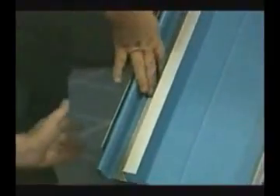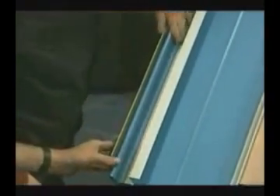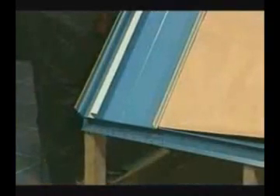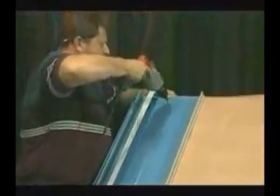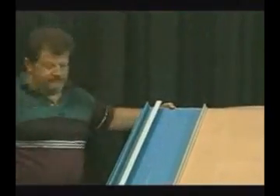The first panel is installed by placing the standing seam part of the panel directly over the clips and then applying constant pressure to the seam until a snapping sound is heard. This ensures that the proper locking has occurred. After the locking procedure is complete, the panel is then slid up into place where it will lock into the eave trim. A screw is then placed approximately one inch down from the ridge to keep the panel from sliding down temporarily.